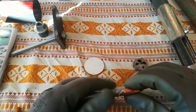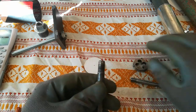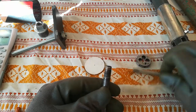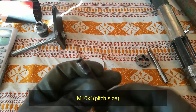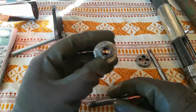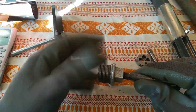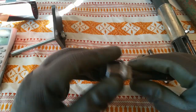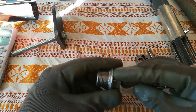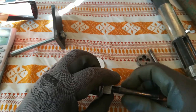On the other hand, you can make a thread — this was made by a cheap set of M10x1 tap and die set, it cost me around 10 dollars on eBay. Then you can tap this plug. This doesn't have to be straight or anything, so you just put Teflon tape and that's it. Of course, you can always drill this plug and just weld the pipe around it — that's two ways to do it.